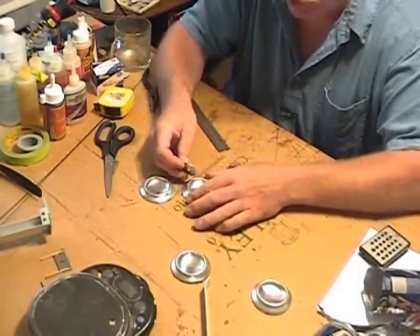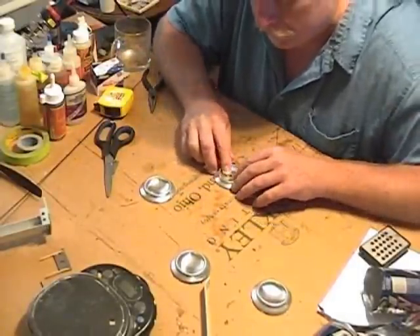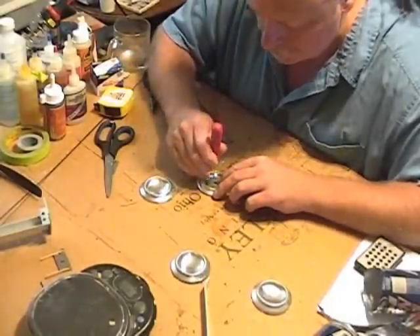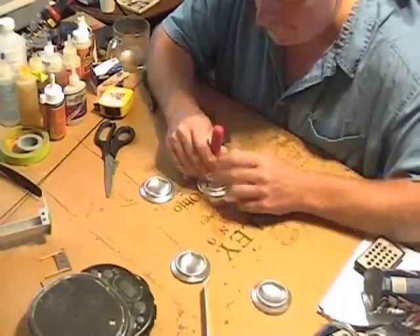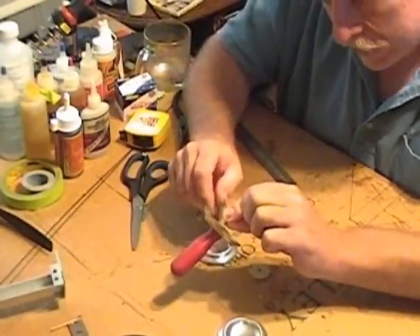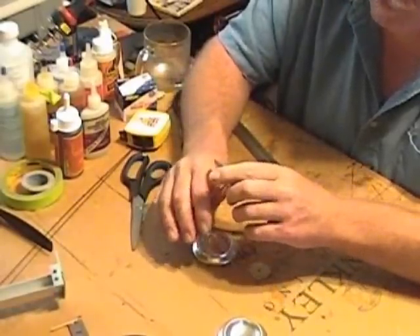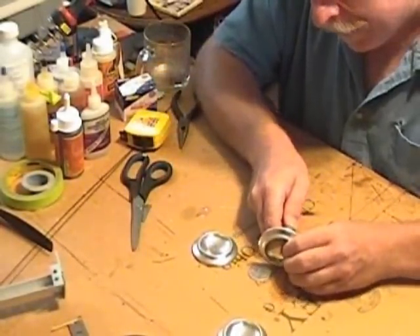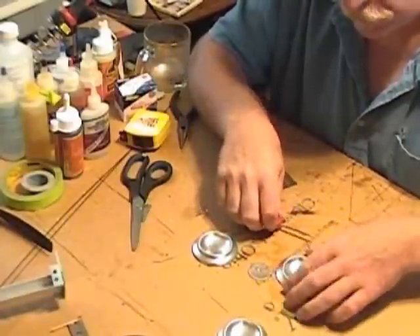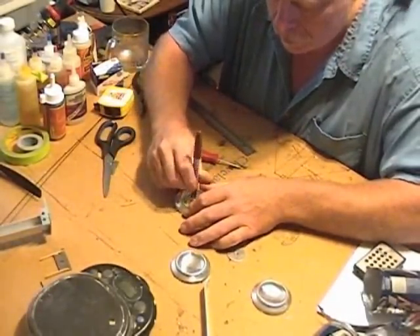You need to find the center, and there are a couple of ways of doing that. I find the easiest is to take something like a washer — anything you have that's perfectly round with a hole in it — and take a small punch. You can check how true it is to center by just spinning it on something. Obviously, the closer to the center you are, the better the wheel is going to be, so I'm trying to be pretty careful.